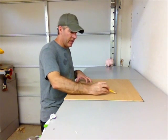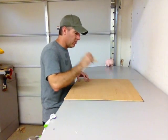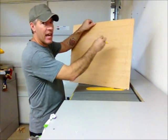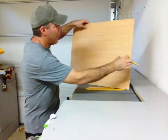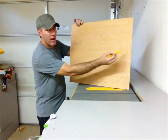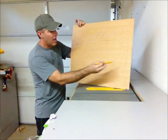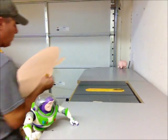I'm actually only drawing half of the pumpkin. I'll take my jigsaw and cut that half out, then take the scrap piece and flip it over to the other side and retrace it. That gives me a symmetrical pumpkin — if I just tried to freehand the whole thing I'd probably end up a little bit off, and it would show.